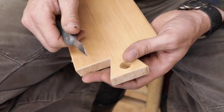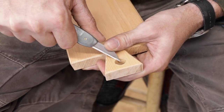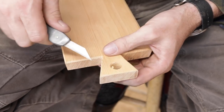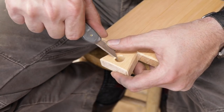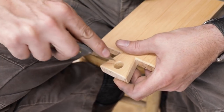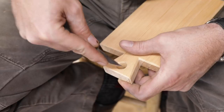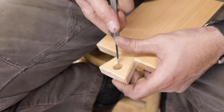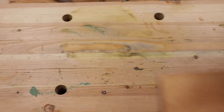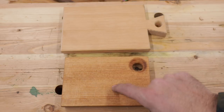I like the hole — I think it gives it an interesting element. But just a straight hole doesn't look good since everything has that micro bevel on it, so you want a very sharp knife and you want to cut a chamfer in here. This is challenging because you're going with the grain on one side and across the grain on the other, so it's important to come from the 12 o'clock position around to the middle, and then from 6 o'clock and meet at the 3.